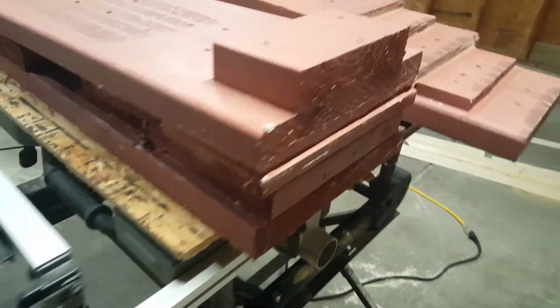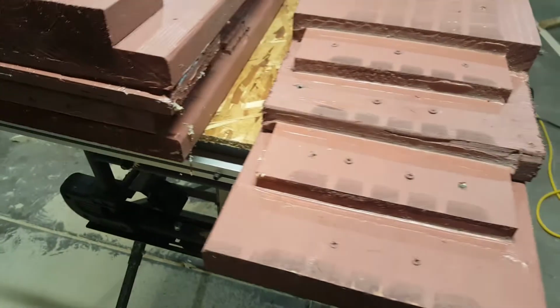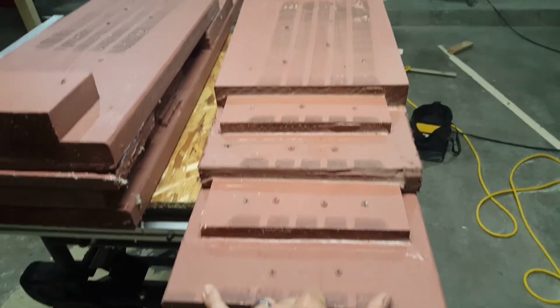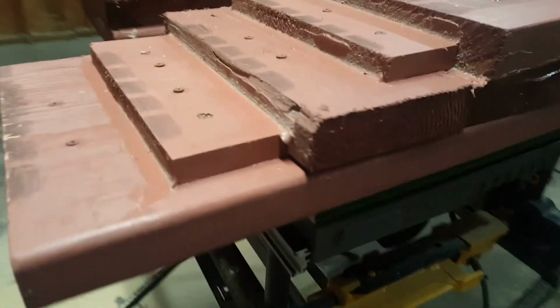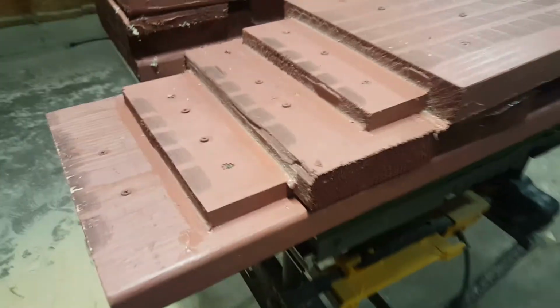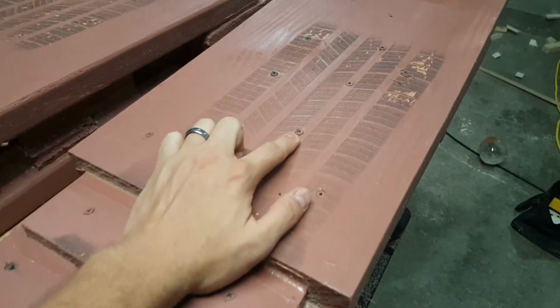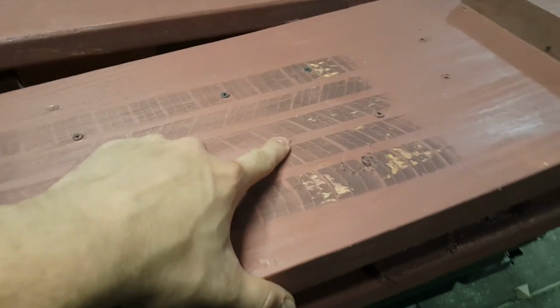I went with 12-inch width as the unit will be less likely to tip and the drive track is easy to guide on. I stepped each 2x12 with end cuts from a previous project using 1x10 pine, so there is no jerking up 2-inch steps. Note that I used plenty of construction adhesive and did not sink my screws all the way for extra tire grip. Rather than step again for the final incline, I actually implemented a small angle.